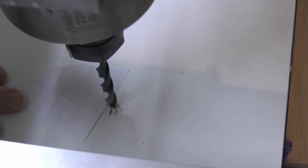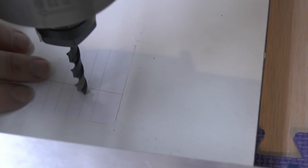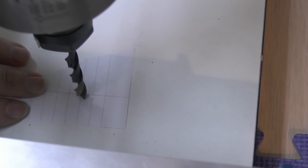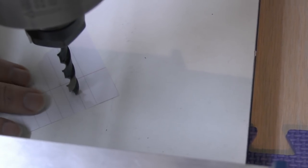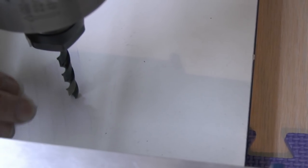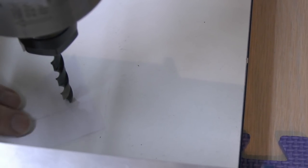So I've just placed the actual drill bit on the zero point — that's the green dot under the bit there. For the Z I'm just going to use this bit of paper. You can get automatic height setters but we don't have one of those at the moment, so that's just dragging there. That essentially is the zero point. Now normally this would be the top of whatever material you're going to be cutting — in this case it's the top of the actual bottom of the machine, but that's fine because that's obviously what we want to cut in this case.